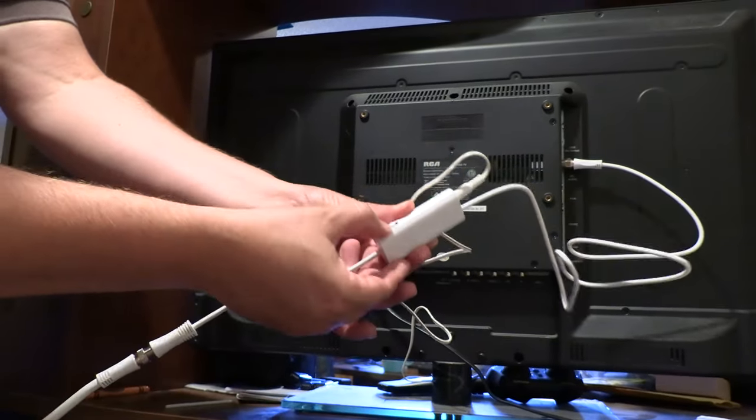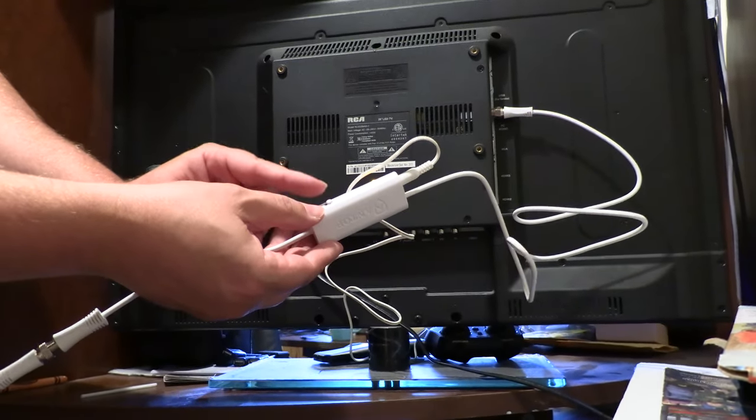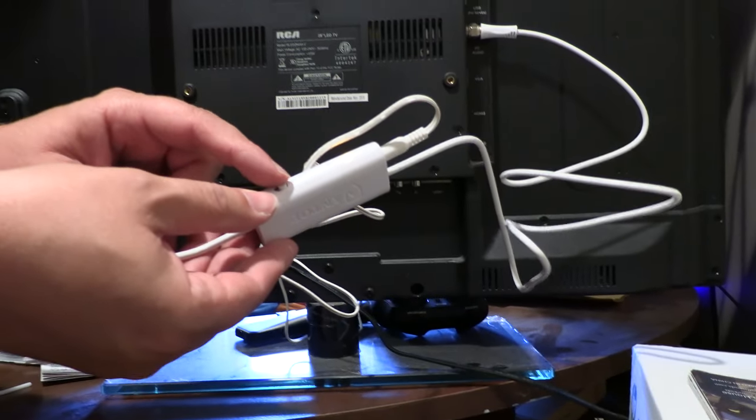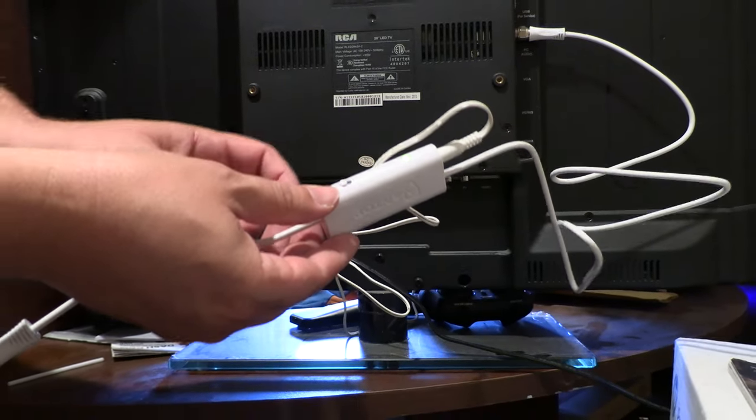And it should be green. If you hit the switch, it'll be yellow. That means the amplifier is not amplifying. But actually, the nice thing about this is it may be over-amplifying. So you could try it with both settings. But probably your best bet, most likely, will be the green light.